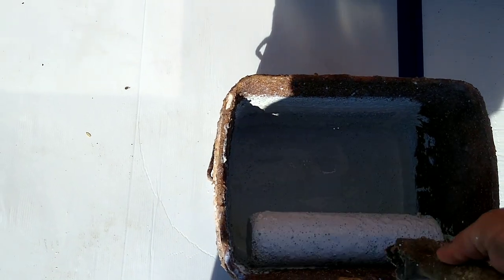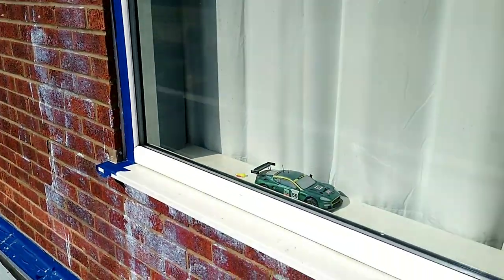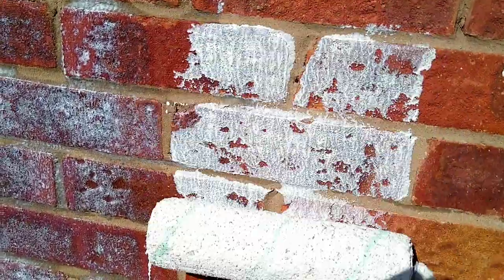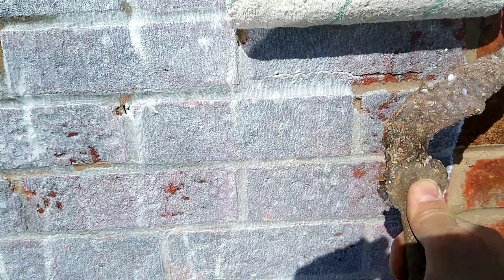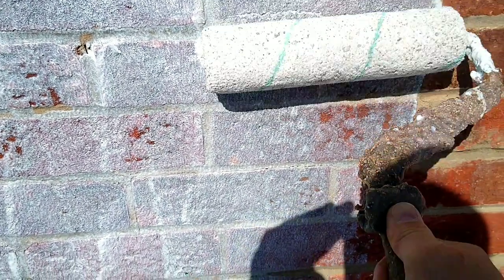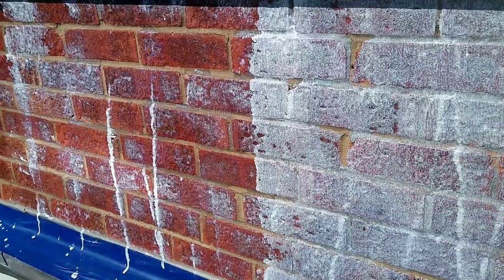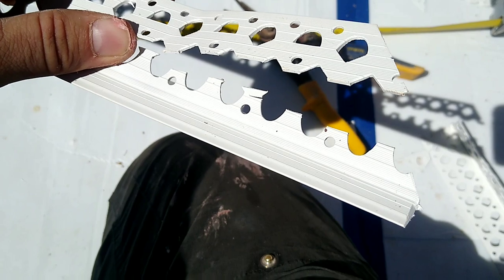The first thing to mention, as with all plastering projects, is the primer. Regardless of whether you're working in high temperatures, high humidity or not, primers are an essential part of your plastering project. To tackle the high temperature and humidity, I've applied SBR chemical neat — straight out of the tub, not watered down at all. The first step is basically to slow the suction down as much as you can, because the Sun has warmed the wall up more than normal.